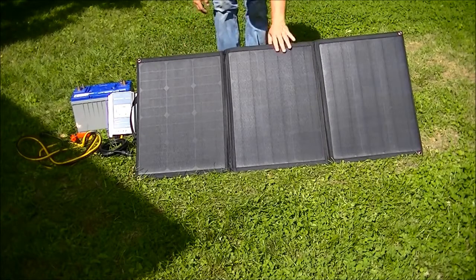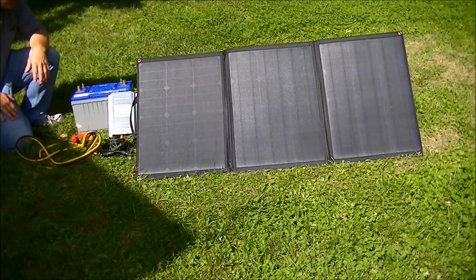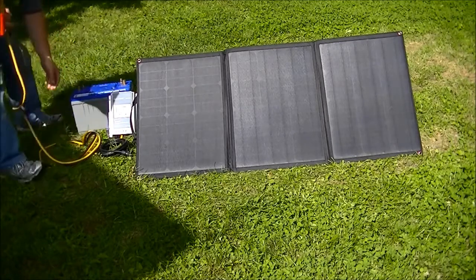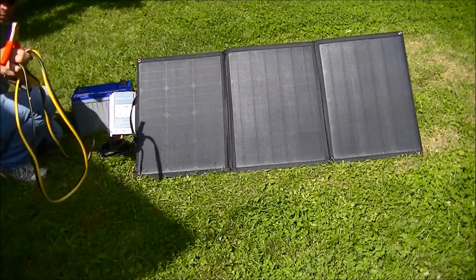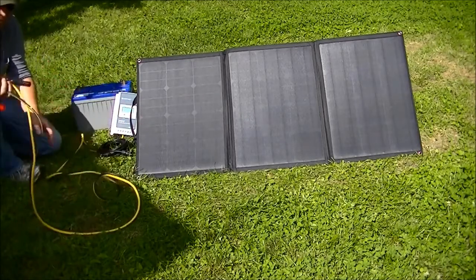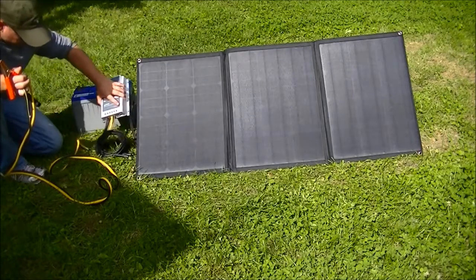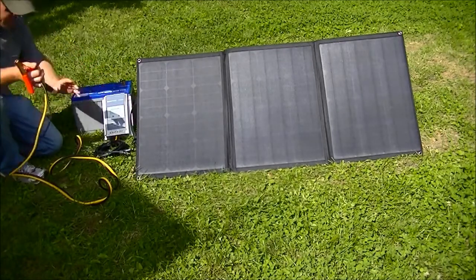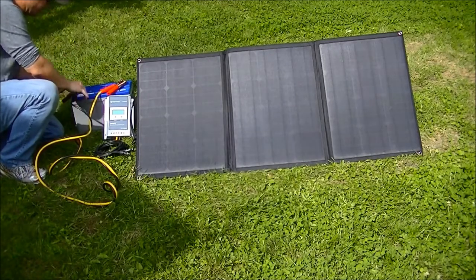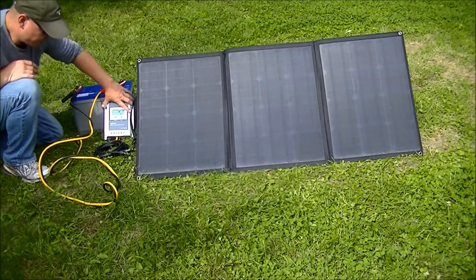For now take a look at the performance of this. Typically with your solar charger you hook up the battery first. What I've done was take 8 gauge booster cables — not the highest quality, cost me about 20 bucks — cut off the clamps and mounted them within the solar controller. I plug this in first and make sure my controller boots up, which it does.